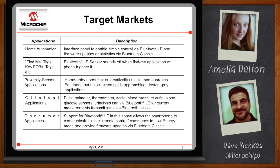Consumer applications — white goods — letting you know your dryer's done on the other side of the house. One may ask why you need Bluetooth low-energy if the appliance is mains-powered. The idea is to keep that smartphone or tablet in low-energy mode while you do your day-to-day work, check status, and get alerts over Bluetooth LE. If there needs to be a firmware upgrade, it can be done over Bluetooth Classic, or for a service call, they can remotely diagnose problems with your fridge or washer. Also, dual-mode functionality enables legacy compatibility — not all smartphones have Bluetooth LE, so dual-mode gives compatibility all the way back to those legacy devices.